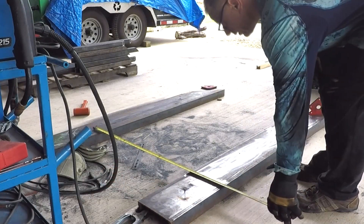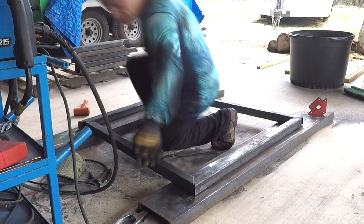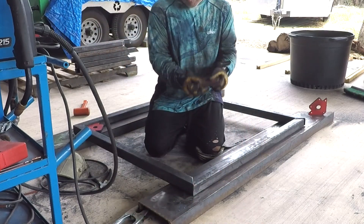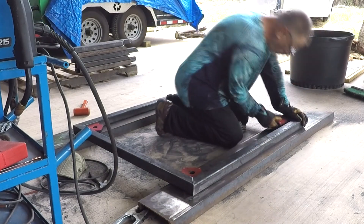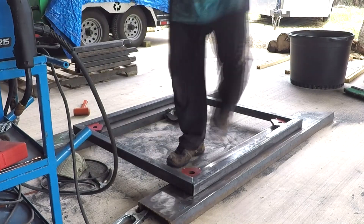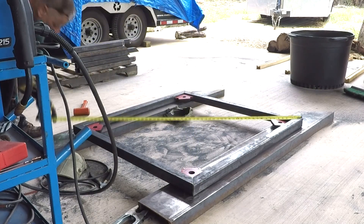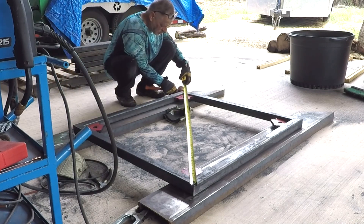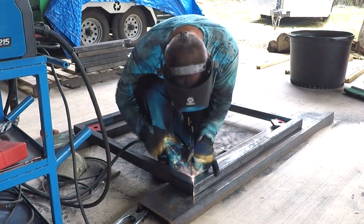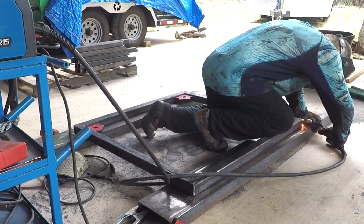We're getting near the end. This is the very last window — now we have 43 windows total after I finish this one, and we're good to go for the installs. The magnets are great, the dry cut saw is extremely precise so the cuts are true and everything lines up nicely. I was happiest when things were just a little bit oversized by an eighth or sixteenth of an inch, because the rough openings call for a half inch plus. The windows are coming in a week and a half, so I'll be installing these frames non-stop.